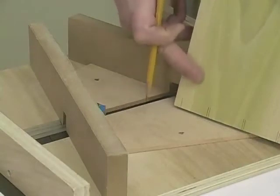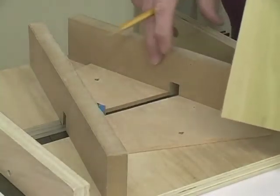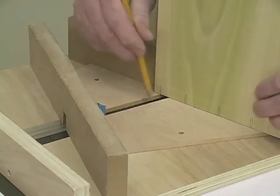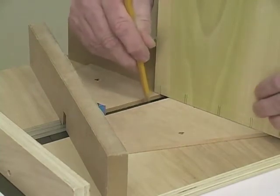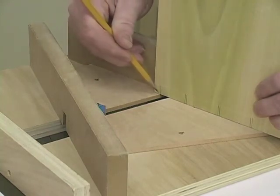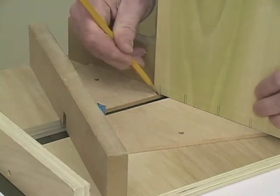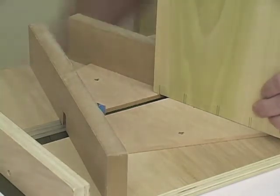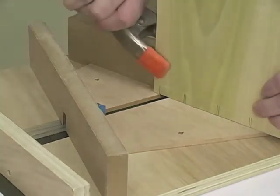So this is our workpiece, and this is the fence that we showed set at a 12-degree angle. We're going to bring the piece in, and since this track is exactly 1/2 inch, we're going to use it to make our cut. Wherever this goes, so will our router bit. And we're going to line this first mark right up at the edge of that cut. Hold that in place, add a couple clamps, and we'll make our first pass over that router.